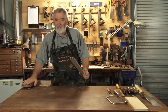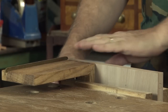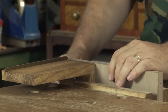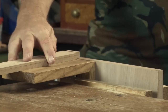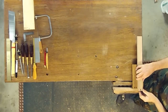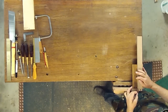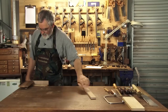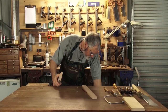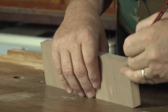Thanks for coming back. Just before the break we cut a couple of dovetails and I introduced you to the dovetail sled. How that works — as you can see set up in the vise — you put the component where your pins are going to go up against your fence, put it in parallel to the top. Take your dovetails up against the fence and slide it along to where your marking line is, which corresponds to the shoulders you've already cut on your rail. Then it's a simple matter — if you prefer using a knife use a knife, if not I prefer pencil. Just trace your dovetail marks and that way you've marked your dovetails out. I always put a cross on the waste side so I remember — I've cut out the wrong side many times.